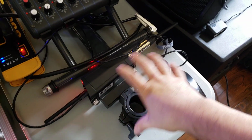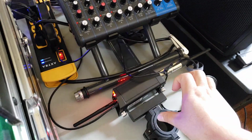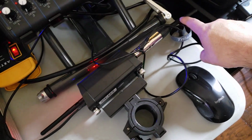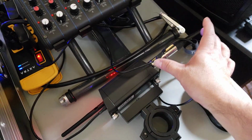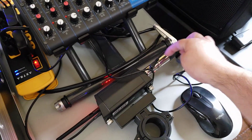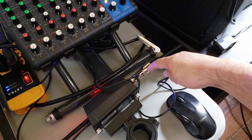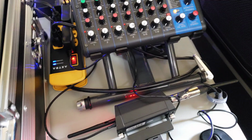I already did a couple of tests on my channel where I tried to get interference. I put phones around this, I put electronic devices next to it, I connected here, I put it over here. I wasn't getting any kind of interference, but where I did get interference was when I got near this antenna. So if you're still getting a lot of craziness, get a 1-foot DMX cable and separate it, make it longer. Connect it to this and then connect this a little further. Or if you have a 6-foot DMX cable, put it somewhere else. Plug it up here and tape the antenna up here so it can be elevated away from this little unit. Try that also. If that doesn't work, I don't know what to tell you.